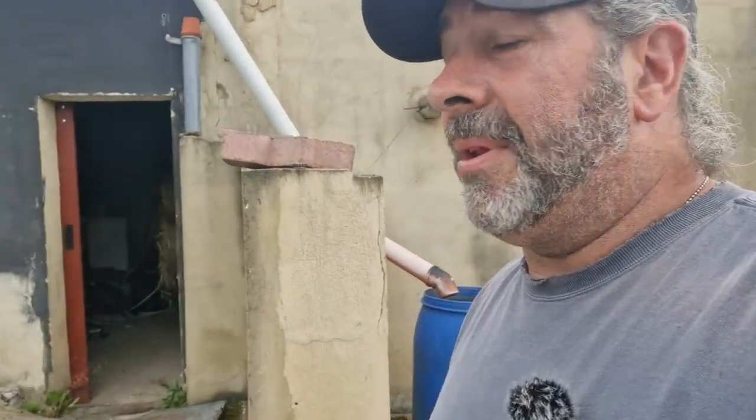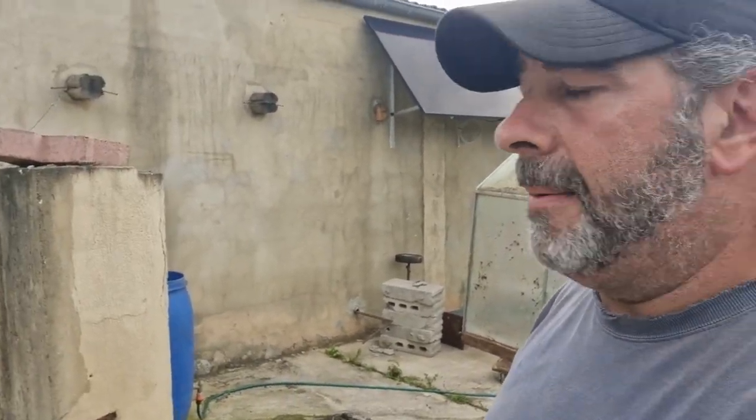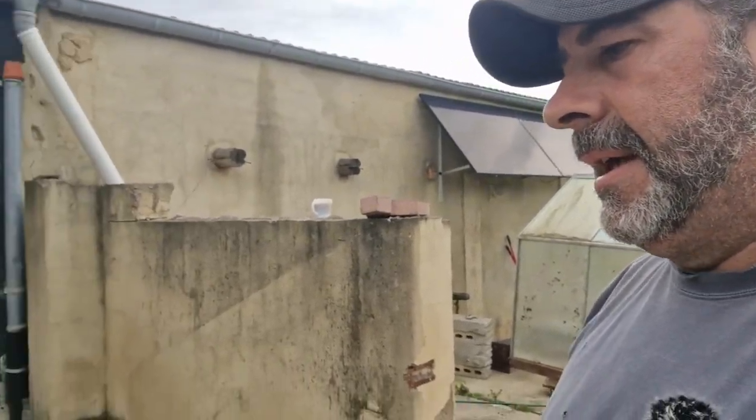And my plan is, and I don't know if it's going to work, to push on the wall with the forks and just try to push it over and then jackhammer it with the pogo stick and see if I can break it all up, and do the same with this pad. The pad doesn't look like it's rebarred or anything like that. So what I'm going to try to do is use the pallet forks on the tractor and kind of lever it up and drop it to see if it'll just break. If not, I'm at it with the jackhammer. But let me get all this stuff wrapped up and get it put inside because, yeah, we're facing rains. So this is going to slow things down a little bit.